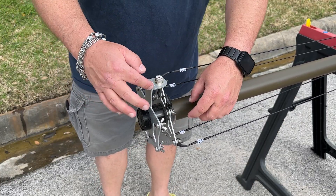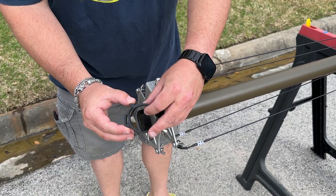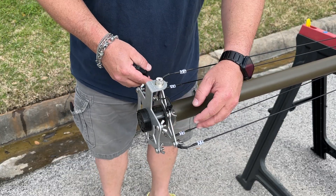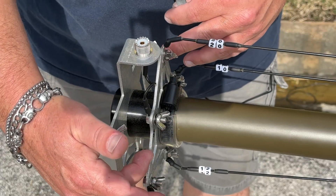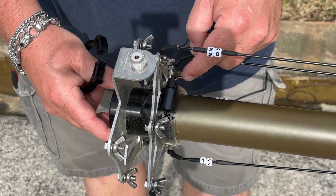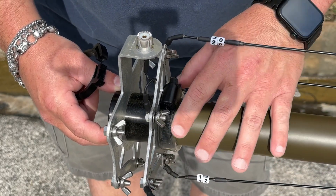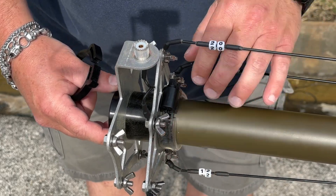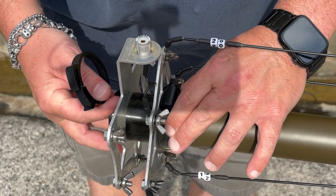One thing about where this driven element plate connects: it came with this clip that you squeeze together, and this is what was supposed to hold the driven element plate in place so it wouldn't pop up when you have all the tension on the elements. But I found when I started making this antenna and put all the wires on, the driven element plate actually slid up a bit. So I took the clip off and fortunately the kit came with this little plastic hose clamp with a hex nut. I had some half-inch tubing from the hardware store and I put the hose clamp inside the hose — because there's a lot more friction, I haven't had any problems with it sliding up. I would recommend using this methodology.